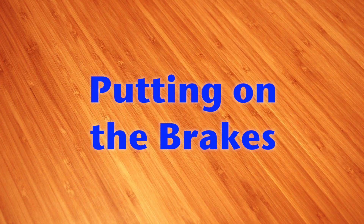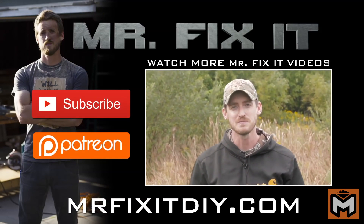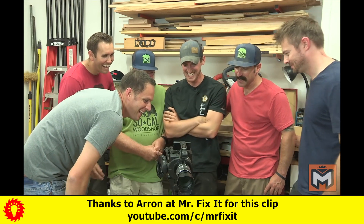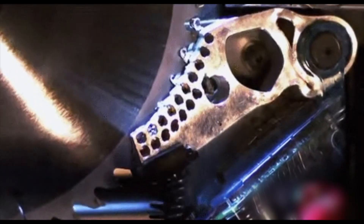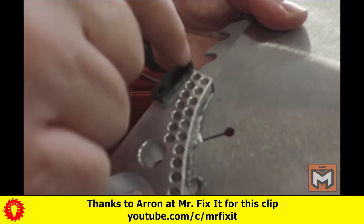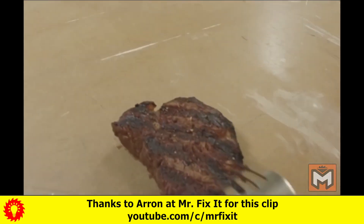You can't talk about a SawStop without talking about safety, so let's take a look at the SawStop brake in action. Shout out to Aaron over at the MrFixit channel for letting me use a portion of his great video putting a SawStop to the test. It startles you, but man, it would save a finger — I have no doubt about that. You can see how the brake gets fired into the teeth, causing the blade to stop instantly. Afterward, you need to replace both the cartridge and the blade, costing from $100 to $200 depending on the blade — but it's cheaper and less painful than a trip to the ER. Run over to Aaron's MrFixit channel to see the entire video.